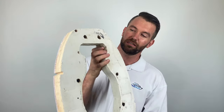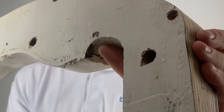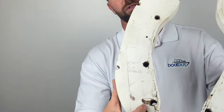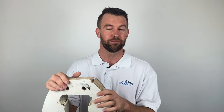What happened on this particular piece was it had a transom assembly mounted, and the tiller arm comes through here. The tiller arm steering seal is here and it leaked into this section. Water was tracking down through the timber and caused this cracking down here. Luckily, the rot hadn't spread to the outer areas, and this piece was the end of the rot.